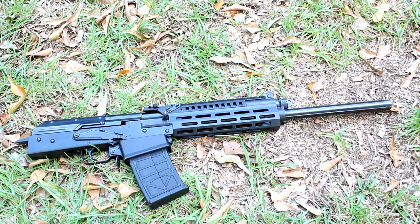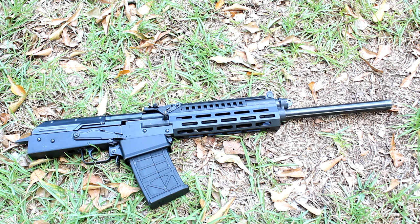So the first thing we need here is an actual gun to fire our blanks out of. And I decided that something 12 gauge would be perfect, as a 12 gauge is about 18.5 millimeters in terms of diameter, which is just a little bit larger than the 14.5 millimeters that the original cannon was. Of course, a 12 gauge shell doesn't have nearly as much powder. However, because we're shooting blanks and not live ammunition, we can actually load a lot more powder into a blank shotgun shell than we can typically load when one's fully loaded with your wad and shot and everything else.